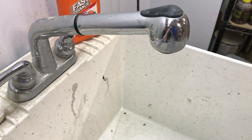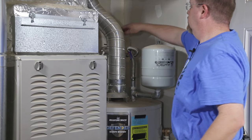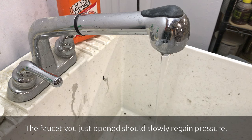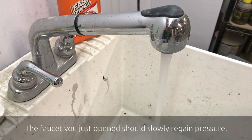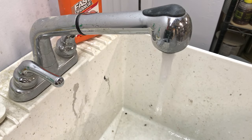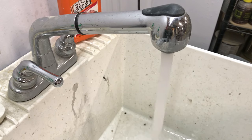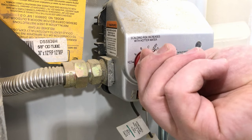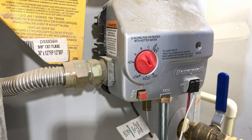Next we can remove the hose from our drain valve. Then we can open the hot side of any faucet and then reopen the cold water inlet to the heater. Don't be alarmed if a little bit of air comes out of your system at the faucet — there was air at the top of the tank and as that tank fills, that air has got to go somewhere. And last but not least, don't forget to set your temperature back to your desired setting for your heater. With the new valve installed, it's a good idea to test it using the same procedure I showed earlier in the video just to make sure it's working properly. As long as that test is successful, you're done. As you can see, replacing one of these really just boils down to unscrewing the old one and screwing the new one in, with a few other steps along the way to make sure you don't spill water everywhere or burn yourself.